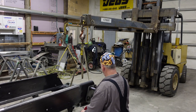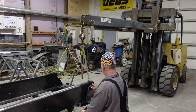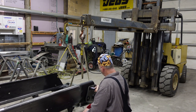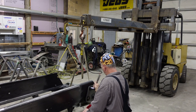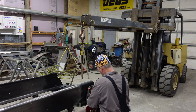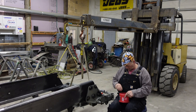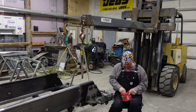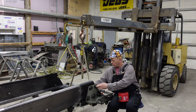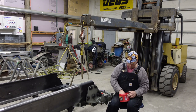These aren't adjustable up here like the inner frame. These are pretty much dead on. This is what they are, is what you got. So there is no adjustment to these front horns because they're drilled true. Like I said, I'm mainly getting things lined up right now, and then going to put those inner frame pieces in where we did the Z or the 45 degree miter cuts in the back.